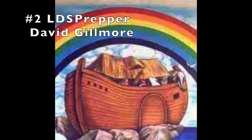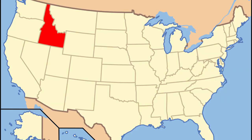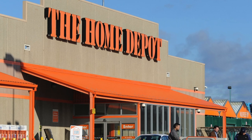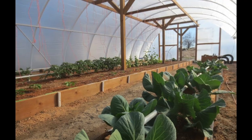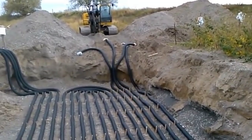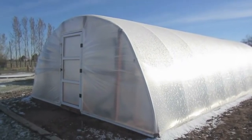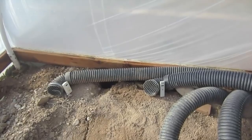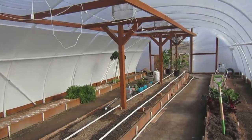Next, we review LDS Prepper's GeoAir greenhouse. David Gilmore, known as LDS Prepper on YouTube, built a four-season greenhouse in Idaho Falls, Idaho with materials most anyone can pick up from the local hardware store, for less overall cost than anyone else has ever done on YouTube. A start-to-finish video series with follow-up a year later shows the greenhouse still in operation. David uses a slightly different approach than Citrus in the Snow — his earth tubes are all underneath the greenhouse itself at eight feet and five feet down, with insulation on the side walls to help contain the heat. His GeoAir greenhouse doesn't just use the ground heat, but actually charges the ground with hot air from the greenhouse during the day, heating up the earth, and then uses that heat later to heat the greenhouse at night.